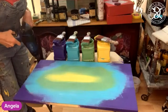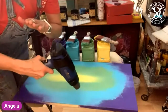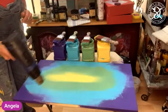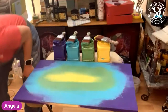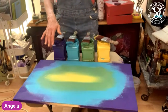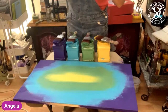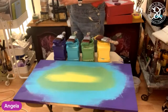One of the great benefits of the chalk mineral paints is that they are self-leveling, which means they level the brush strokes out during the drying process. So obviously if you use a hair dryer or heat gun, you're interrupting this process. You also don't have to seal these paints - they're self-sealing. They dry open pores and have a flat finish. If you prefer a different touch, you can use wax or a top coat of your choice, but you don't have to.